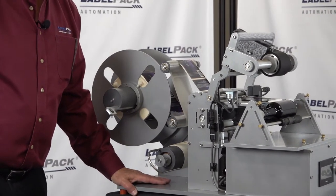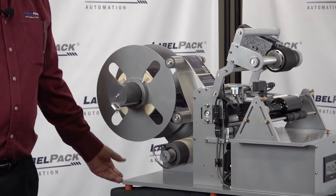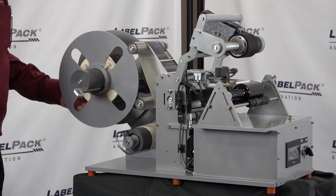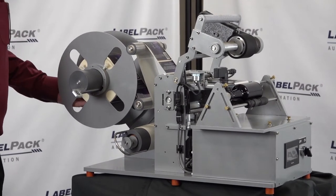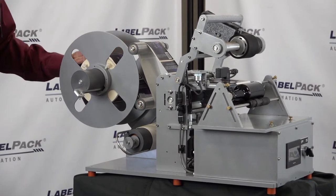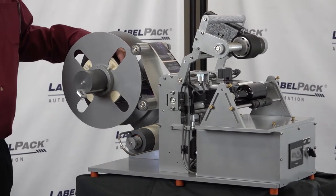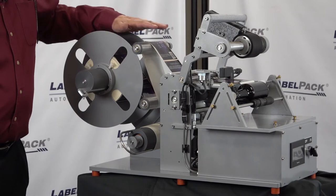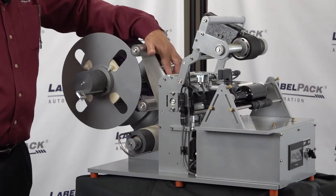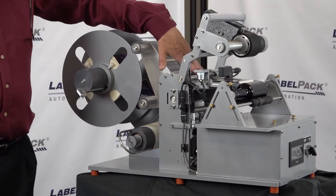Our tabletops are all anchored to a half-inch base plate so that the vertical plate can be held true, keeping the path true so that you minimize any label jams or anything of that nature. It starts with the supply roll — 3-inch core up to a 6-inch adapter, with a 12-inch OD on the supply, expandable to 16-inch OD if necessary. Through a dancer, which manages the back tension on the supply roll and minimizes any overturn. There's also a secondary back tension control on the dispensing platform.